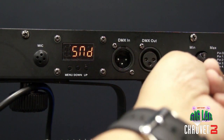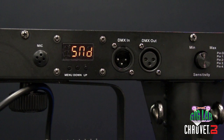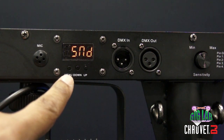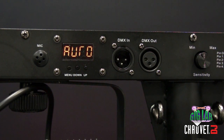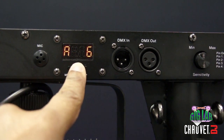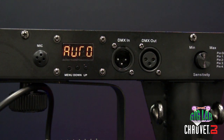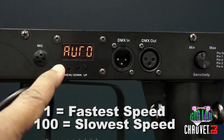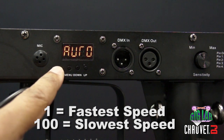You can adjust the sensitivity with the sensitivity knob for sound activation. If I want to go back to auto, I go back to the highest hierarchy level by hitting the menu button twice, hit the down button, and now I'm in auto. We can change the speed of the auto programs — just like changing the DMX channel, I hit menu once to go to the next level, which is speed. The interesting thing about the four bar is that level one on the speed option is actually the fastest speed, which is opposite to what you might expect — on the four bar, speed starts fastest at level one.